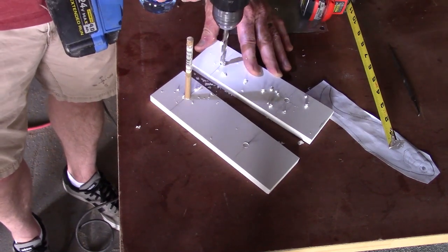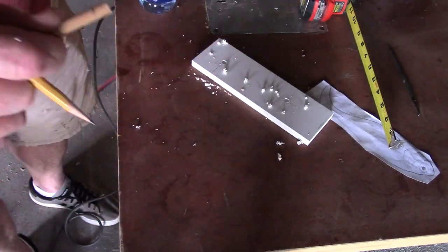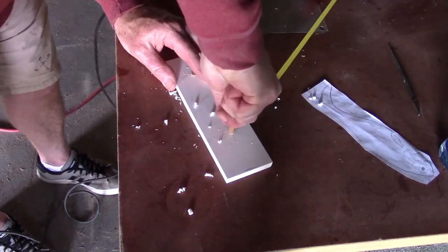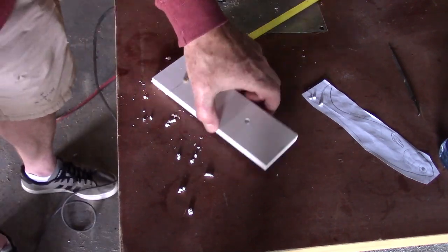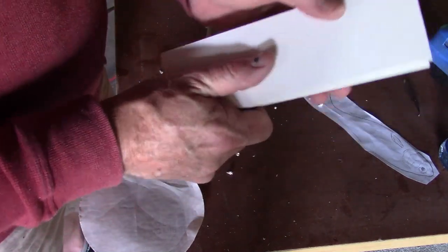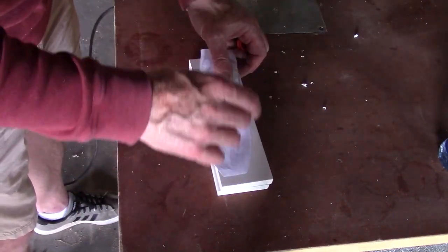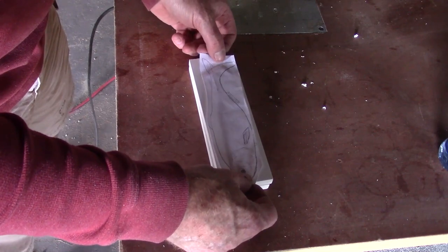When I get ready, I can split the lure perfectly in half, and this really makes it nice for molding. When it comes time to have the lure halfway into the clay so I can pour the rubber around it, all I have to do is separate the lure and divide it back in half. I've got to get a different kind of glue — I've tried spray adhesive and it's messy; this stuff here is not going to cut it.